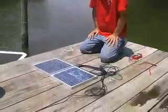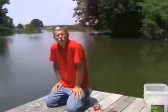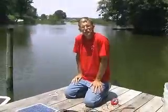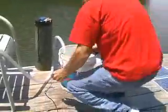These two panels are connected in parallel for a total of 12 volts. I did run the pump earlier and it looked like it was putting out about 1.2 amps — a little less than the spec for the bilge pump, but it seems to be working pretty well. Let's go see how the output works. I need to not stand in the way of my panels.